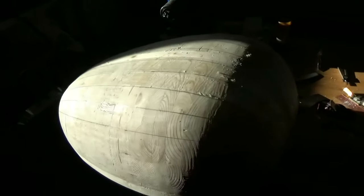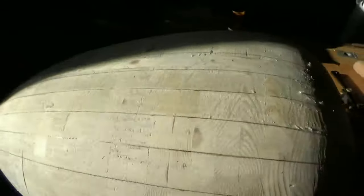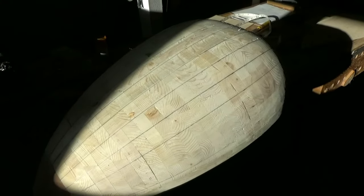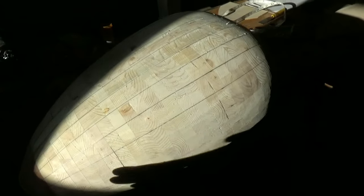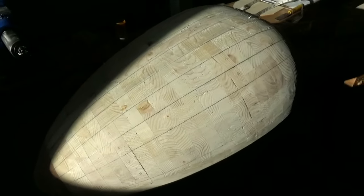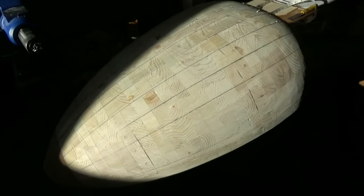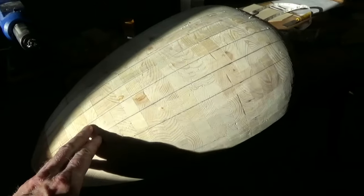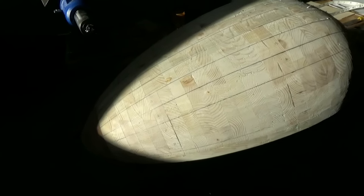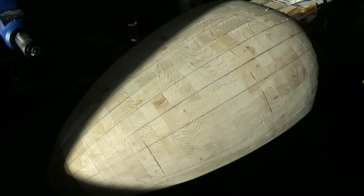You can see that I can join exactly where the ribs meet together. This mold took quite a while to make. These molds are quite slow to make but once you've got the mold made, it's amazing how quickly you can make a bowl and of course you can make many, many of them. I used to make them with some of the sections missing on a board on the bottom, screwed from underneath, but I found that wasn't very accurate and I didn't like the results. So I went to the extra extent and now make them with pine shelving, which has been sanded down to perfectly flat. It's easy to glue, easy to work with, quite soft. You just have to be careful to avoid knots - you can see knots here - and generally that's worked quite well.